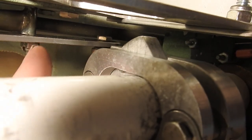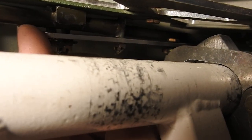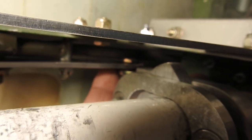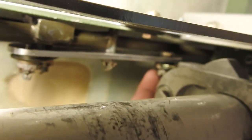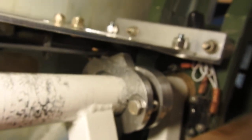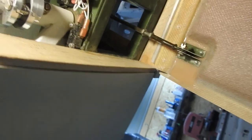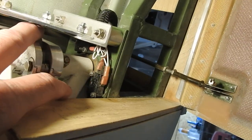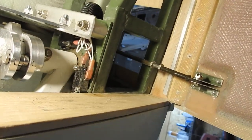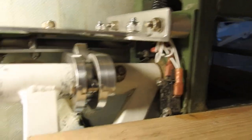This is a piece of ⅛-inch aluminum cut out with the CNC. It pivots on this center point and traps onto the tube that goes to the gear door. It's like a teeter-totter — instead of pushing up at the original point, I stretched it past the pivot point and I'm now pulling it down. I figured the mechanism would work a lot better pulling down than trying to push up. Right now it's in the full extended position as you can see by the doors, and they won't move. It'll need some fine-tuning, but I need to disconnect the doors, get the gear swung up, position the cam, and get the rods in.